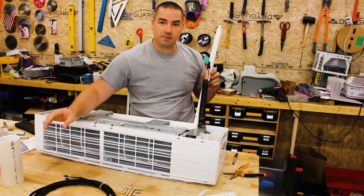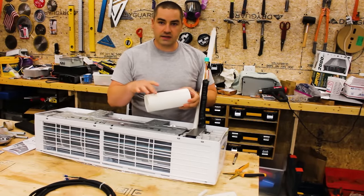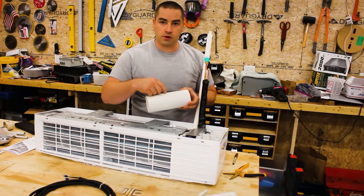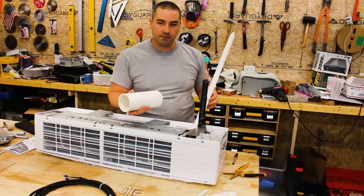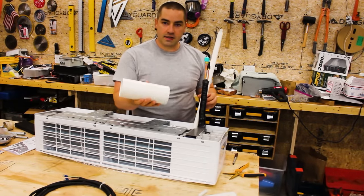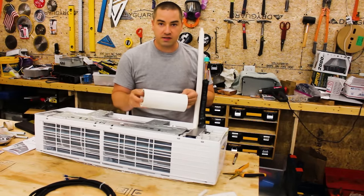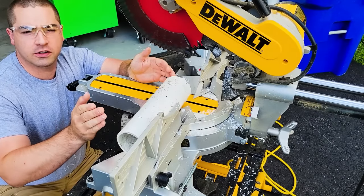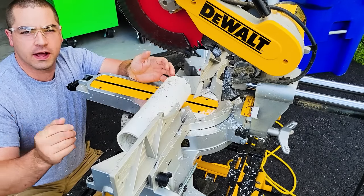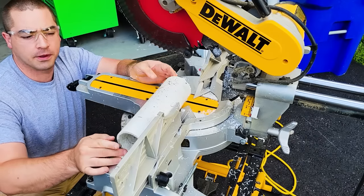And by the way, the reason that I'm talking about pipes is that I want to sleeve the wall so that the insulation isn't exposed to the hole and I won't get the wind blowing in or critters coming in. So having a sleeve in the wall is a good idea. Now this one is a 3-inch PVC schedule 40. I'm measuring my particular pipe to 8 1/4 inches long, but you'll have to measure your own wall thickness to know how far to go for your application.